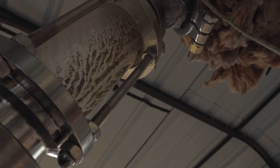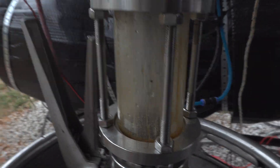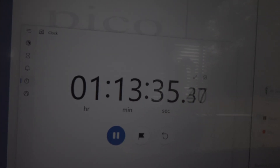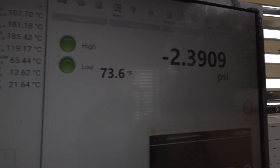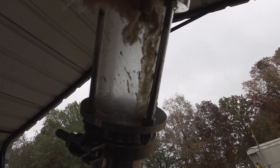Not as good a flow as I would expect, considering the vacuum pump is constantly sucking all the vapors out of this machine. As you can see, I was touching the pipes to check if the condenser is doing its job — is it keeping things cool? Because look at the temperatures: the machine is getting hot at this point, over 100°C on every point on the body. Just so you know, water boils at 100°C, so when it gets over that, things start to get really hot.